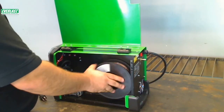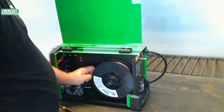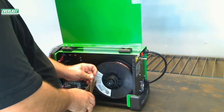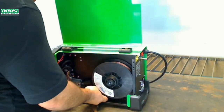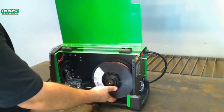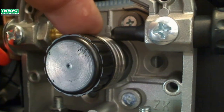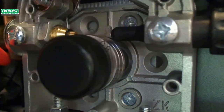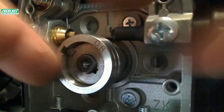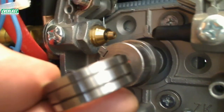Once the wire tension has been set, carefully remove the wire that is typically secured to the side of the roll. Do not allow the wire to despool. If necessary, place your free hand directly on the wire during the process to prevent the wire from decoiling from the roll. Trim the wire so that it is straight and will feed into the wire feeder. The wire should start smoothly into the flexible pickup tube on the wire feeder. Before feeding the wire further into the gun, check and make sure the correct drive roll groove is selected. Remove the black retaining nut by turning counter-clockwise, and then carefully remove the outer drive roll from the inner carrier. There is a square key that holds this in place. Once you verify the correct groove will be used, reinstall and tighten the nut.